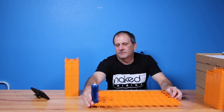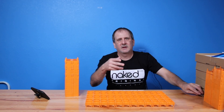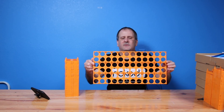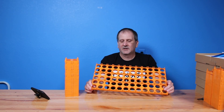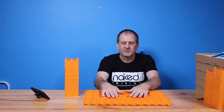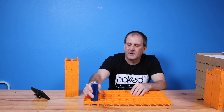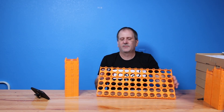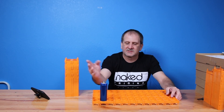For this first build, I've already done the first plate and I'll build a second plate on the video. This is similar to the plates you build for the 18650 batteries — they just pop together. The nice thing I like about these is they give you a little extra room because you've got to put the bus bars on. These little divots keep things off level. You can trim them down, but your batteries will stick out the bottom a little bit, so be mindful of that.